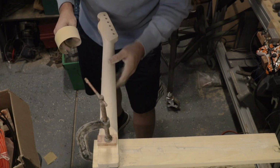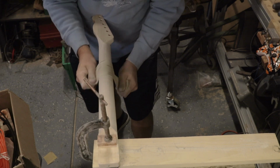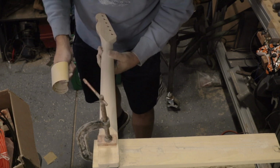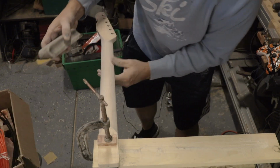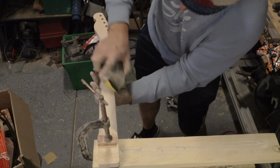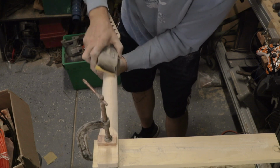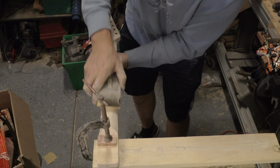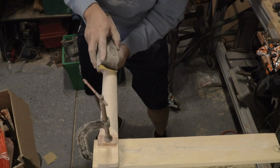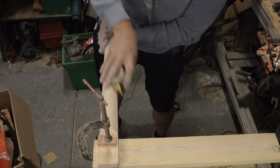And I feel one little spot here that I don't really like. Still not digging it. Now, when I use a smaller block, you'll notice I do an X pattern. So I'll push and I'll pull, and it's so that your reference is always longer than your sanding block.